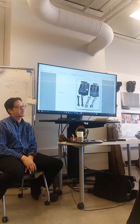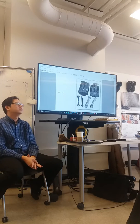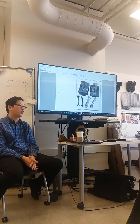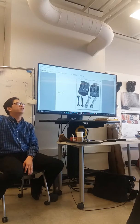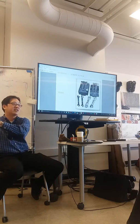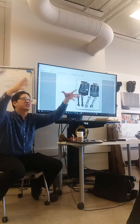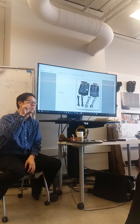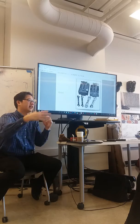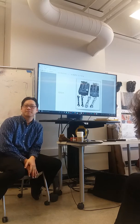Student: So you're talking about the assembly steps - would you have a specific assembly for components within the computer and then have that just dropped into the assembly for the computer? A lot of times that is the case. In factories, they sub-assemble first. When you build a Ford Explorer, the instrument panel comes in completely built from another factory next door - Tower Automotive or Visteon Automotive does the instrument panel and ships it as a whole sub-assembly. The design for assembly engineers just slot it into the car. The final assembly plan is where the car gets built from all its various parts. You don't want to build the headlight all by itself - bulb, reflector, glass, wire. You want that to come in as one part, a sub-assembly. And when you all do this in SolidWorks, you'll be making assemblies.